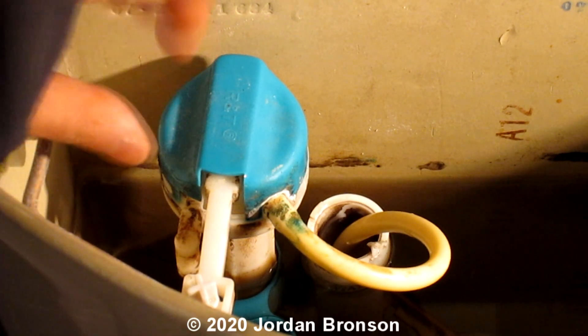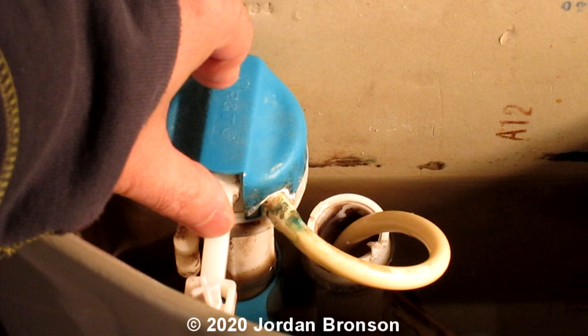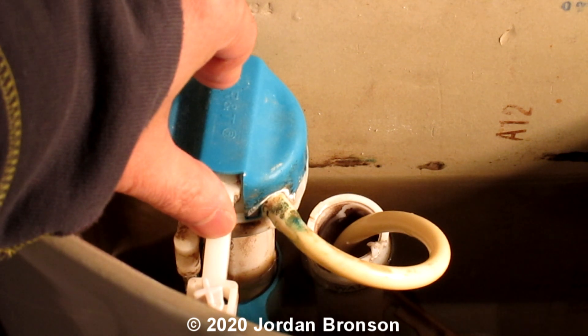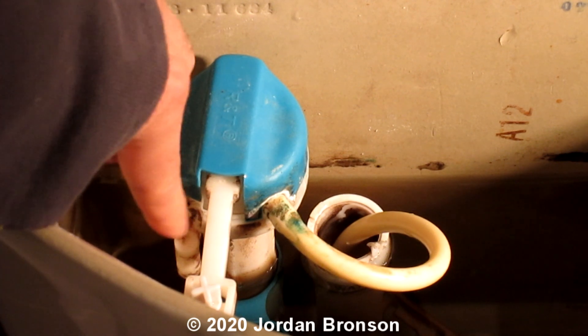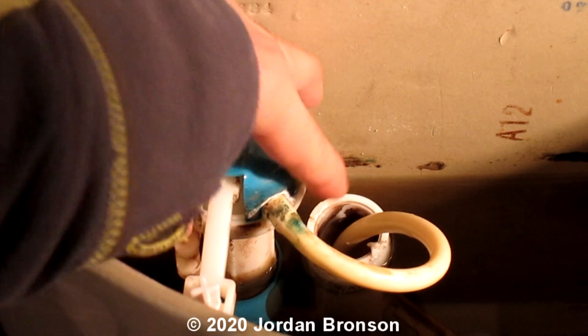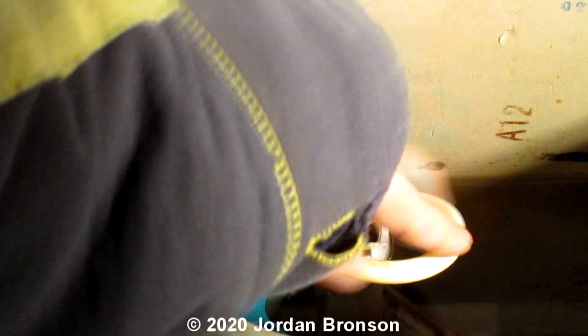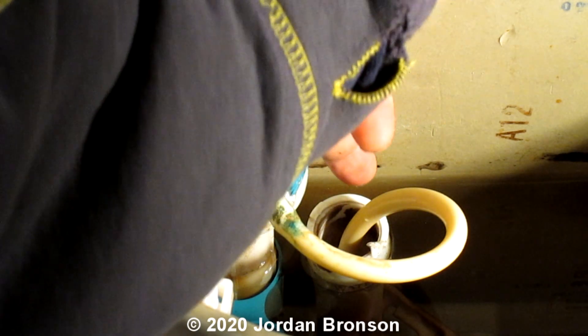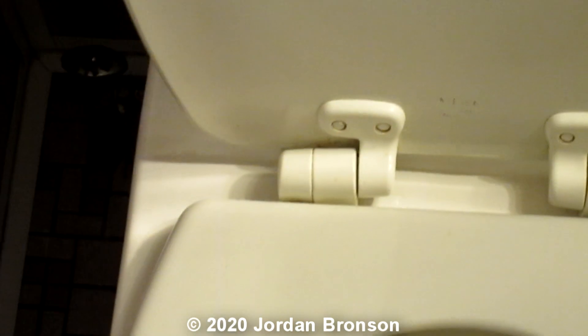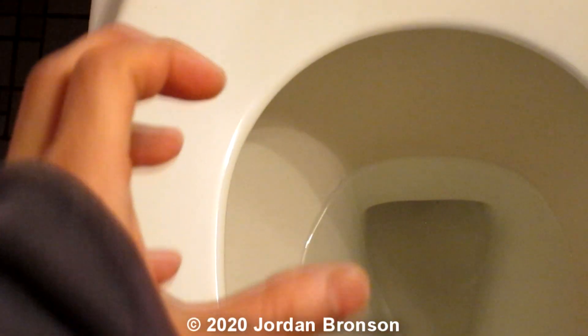You hear that little hissing noise because the gaskets in here are a little shrunk, so it lets water through. You hear this hissing noise and sometimes there'll be a little leakage. Sometimes it'll leak up to here because it's meant to overflow, then it closes and fills up the tank. Another way you can see it — if it leaks a lot, you'll see water coming out of this tube, and when it overflows it goes into that tube and leads down here.